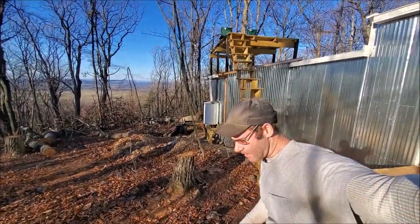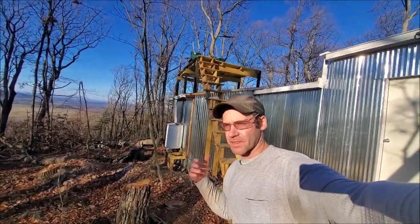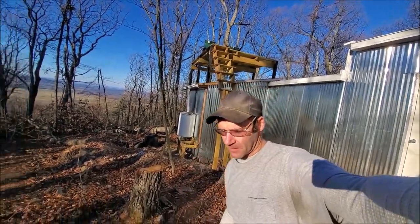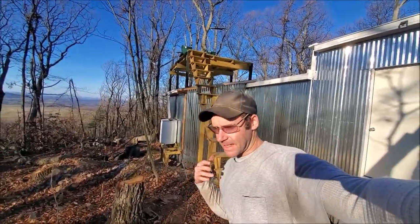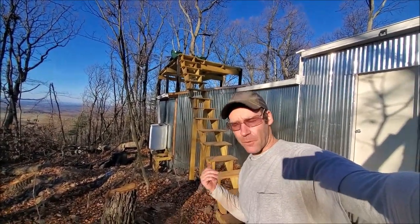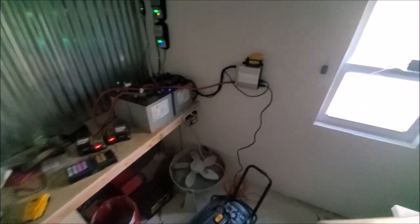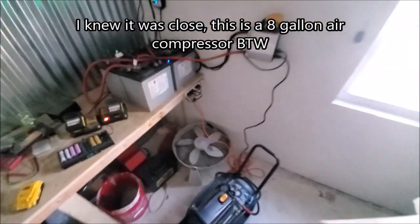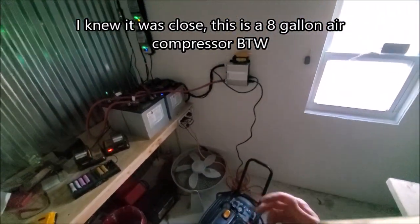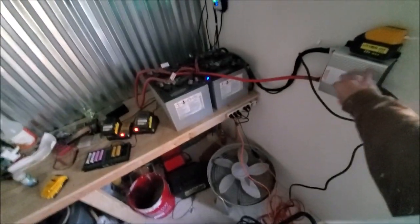I went ahead and looked, and it's 12 amps, so basically it's just under 1500 watts. But the startup for that thing, everything's not perfect with electricity, the startup just can't quite make it. The 12 amps is just under what the inverter is rated for at peak wattage, but it's just not enough to get that compressor started. I'm not exactly sure how many watts 12 amps is, but it's too much wattage to get this thing started off of this inverter. Basically, this thing has been great, and as long as you're not trying to run too many watts through it, it'll work great for you.